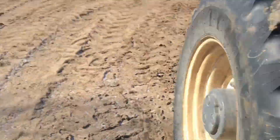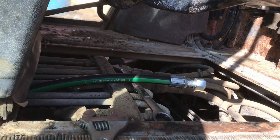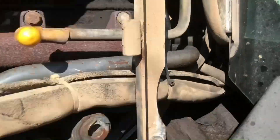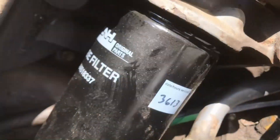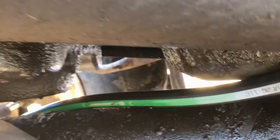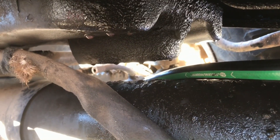It's cold out — about 12 degrees with snow. We've got the new hose kind of routed. It connects right here; we just had a regular hose made in town. It goes under the cab floor, down behind the filter, then straight down across the top of the four-wheel drive shield. You can just see through there the T that goes into the cylinders on the other side.